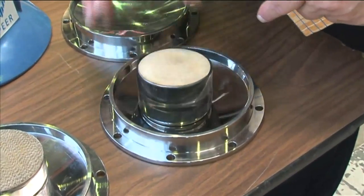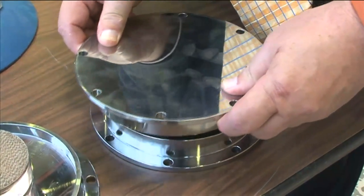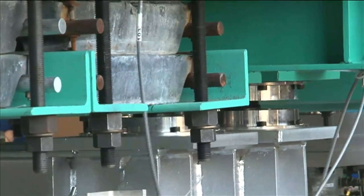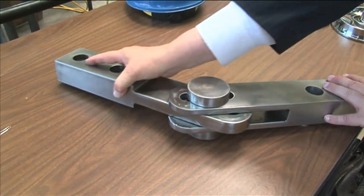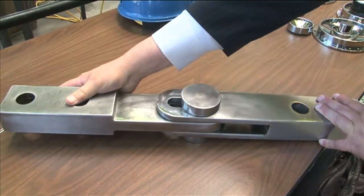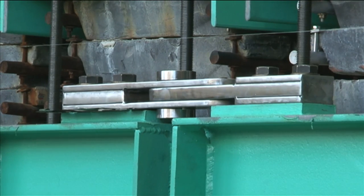This is then covered with another one of these so that during an earthquake it can rotate, but also can move sideways as you saw in the test. We have to guide the various segments of the bridge so that they act in unison. To accomplish that we have these lockup guides, which allow the bridge to move and it's guided in longitudinal and transverse displacements to do what we would like it to do.